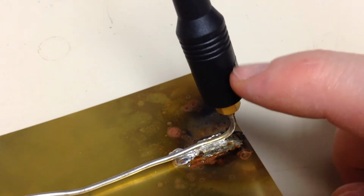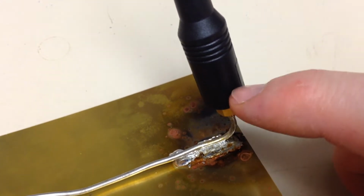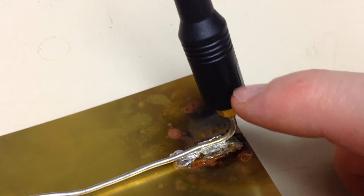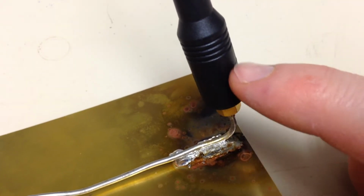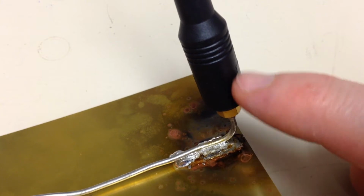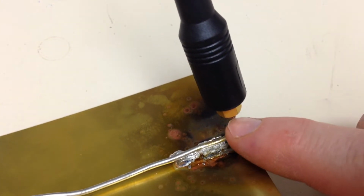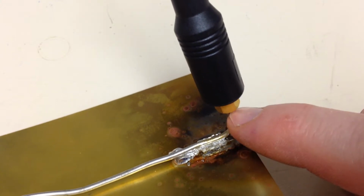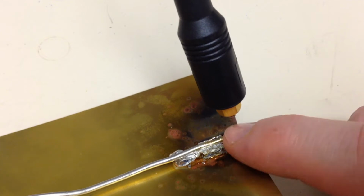We've got the lower section of the base here. The upper section has the coil, and the lower section is just the connector. So as I move my finger along this lower section, you're going to see a response on the network analyzer. The SWR is going to change all the way up to 6 gigahertz. If I run it along the base length of the cable right here, it's also going to see that because this part is radiating right here. It's part of the counterpoise.